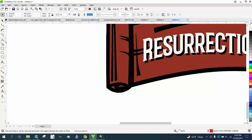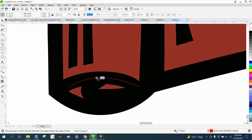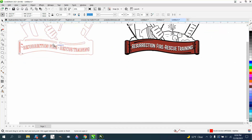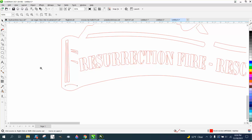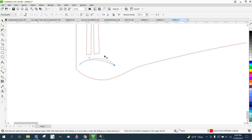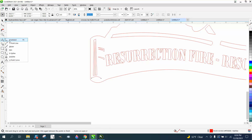I am not a graphic artist, but especially with a plasma cutter you could take just single lines and not cut all the way from end to end. Let's take our three-point curve line and do our three-point curve line, going from right here to right here, set it, then move it over. Then I would put in these other graphics that aren't in there. You could possibly just put in a line — it's not in exactly the right position but now we can grab our shape tool to make it look like a scroll.